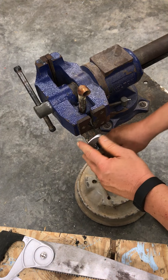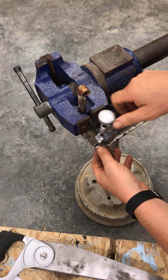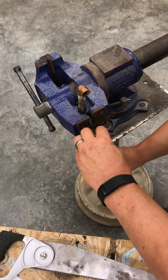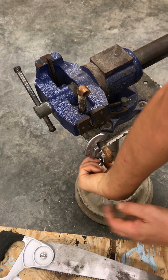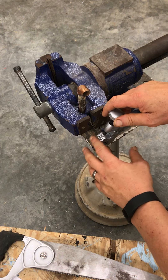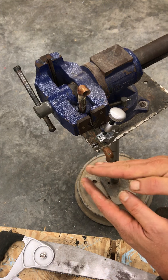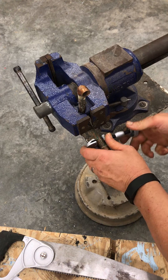You go around in one direction, then back in the other, and then tighten it about a quarter of a turn. You go around and back the same way you came, tighten a quarter of a turn. The reason you keep alternating directions is that if you kept turning it clockwise, some of these the cutting wheel is not perfectly lined up and it will actually walk — like cutting threads going down a pipe — instead of sitting in one place and cutting through. It'll start walking down the pipe.